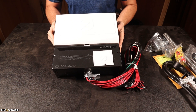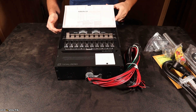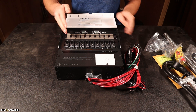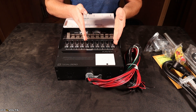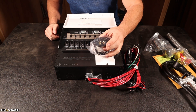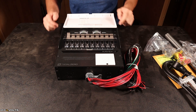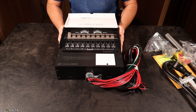Let's take a close-up look at this transfer switch and discuss how it works. This is the Goal Zero Haven 10, a 10-slot transfer switch with 10 different switches that have three positions: grid, off, or external input. Those coincide with 10 breakers — four are 20-amp and six are 15-amp. Down here is where I'll install a plug for secondary power, and there are meters up top to read watt values being used.